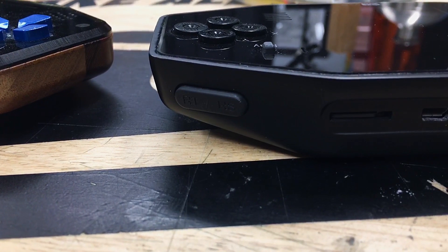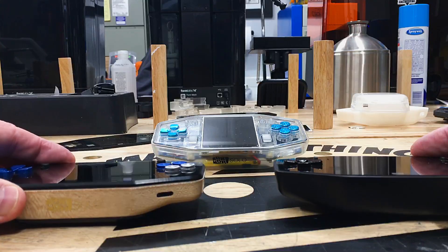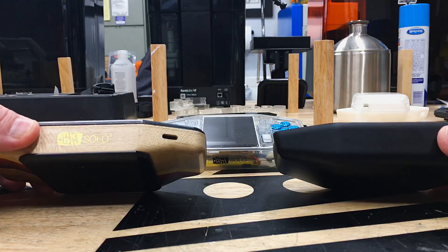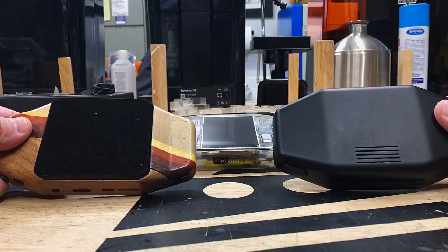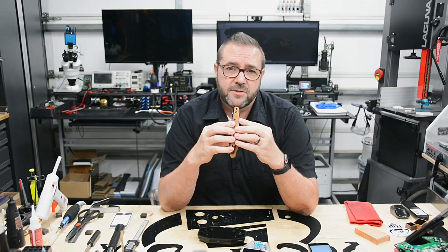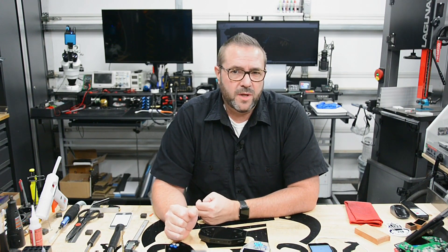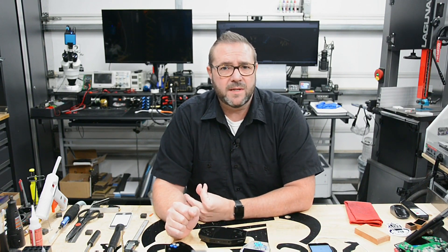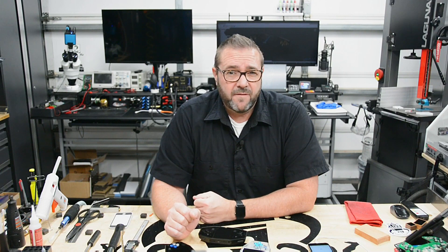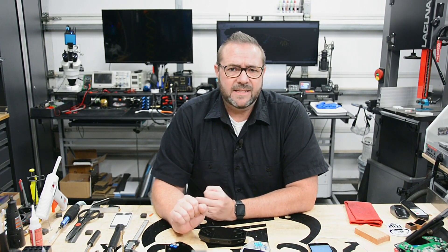I improved the power button slider design for smooth operation, added names to the shoulder and power buttons, improved the ergonomics of the body design — it's a little more round and smoother and easier to hold. I removed the magnetic face and rear back access panel to address electronic issues in Fusion 360. I replaced the HDMI output and added a volume control wheel, then replaced the composite video for SPI-based ILI9341 displays.